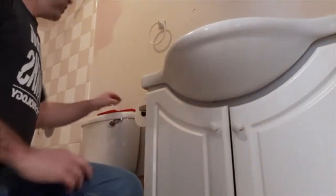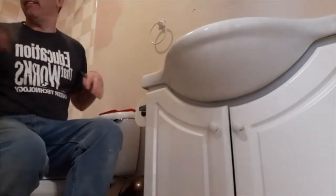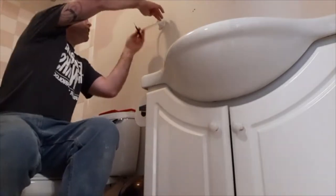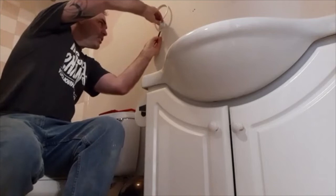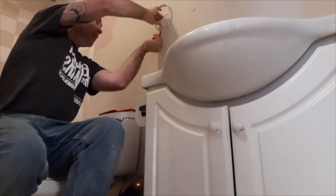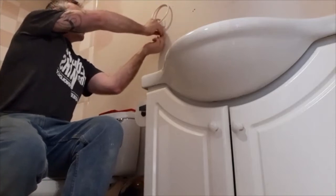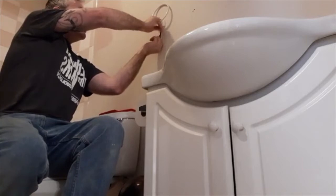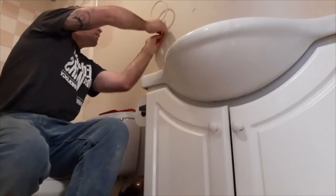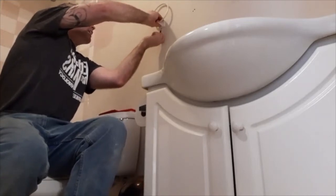The next thing I want to show you real quick is this towel bar. This is for the hand towel. There's a few other ones. Most of these things always have like a small set screw underneath. I'm using a real small eyeglass screwdriver for this one. Sometimes they're Allen wrenches. Sometimes they're a small straight screw like this one. You loosen it up from underneath. You gotta get it all the way because it just holds it on a small clip behind there.